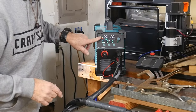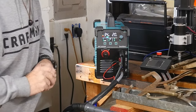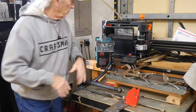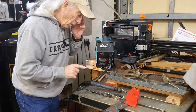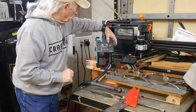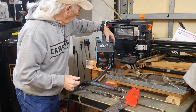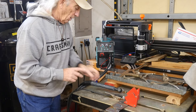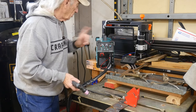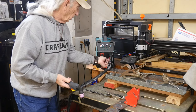When I turn the machine on with air pressure plugged in at the back, there's a really cool gauge on the front where you can adjust air pressure up and down. I've got one green line plus the red — it'll also go back into the red if you have too much air pressure. For this three-sixteenths steel, I'm cranked down to 20 amps. When I release the switch, the air will continue for a few seconds. The cooling fan isn't running right now since the machine is cold — it'll kick on once the machine warms up.